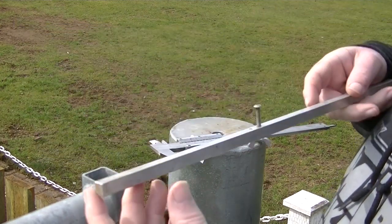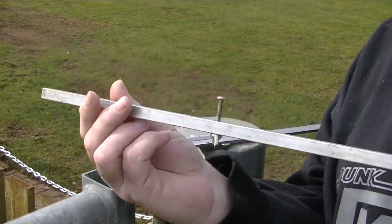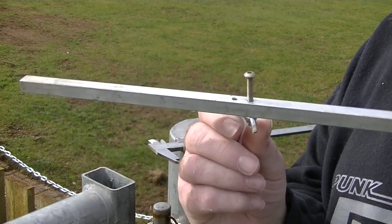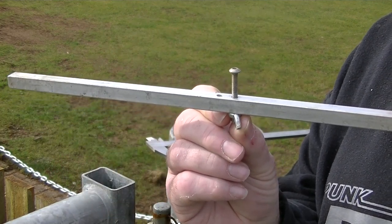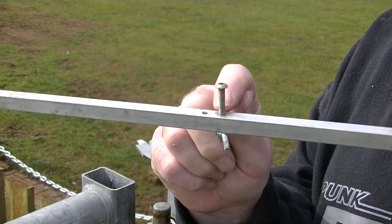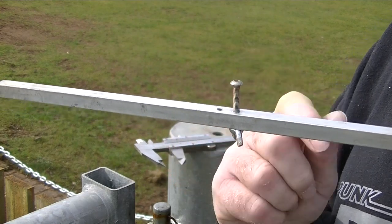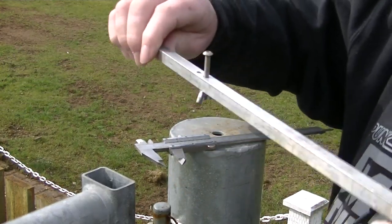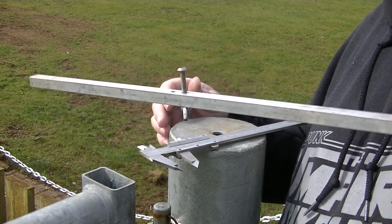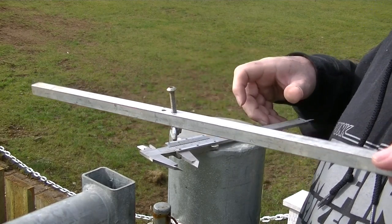Here's the first tool: the setting bar. There's a screw there and the wing nut. And that is the height that we want to set. It's currently set at 18mm.